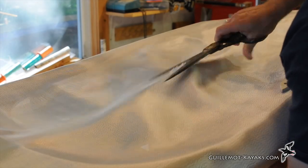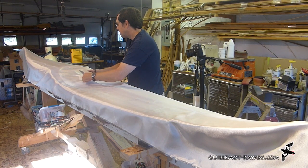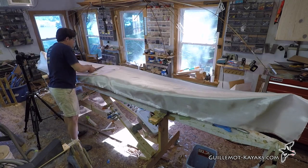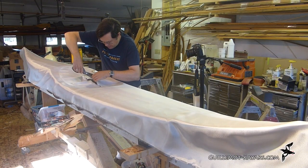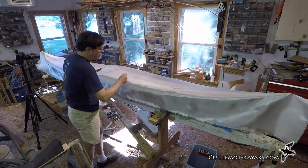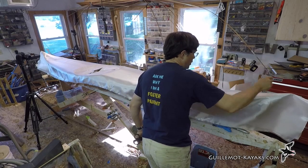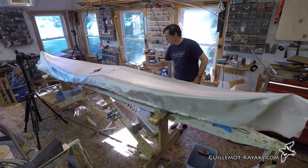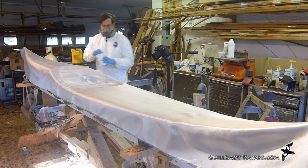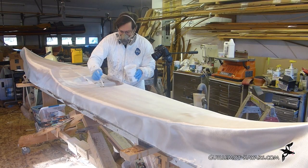The recessed combing is a little difficult for the glass to conform to. By making some cuts in the cockpit area I can relieve most of the tension in the yarns that might prevent a smooth fit. I always want to start applying the epoxy resin where the cloth will have the hardest time conforming to the surface. Dry cloth can be fairly easily distorted to drape smoothly, but once it's wet with epoxy it's harder to warp the weave around complex shapes.